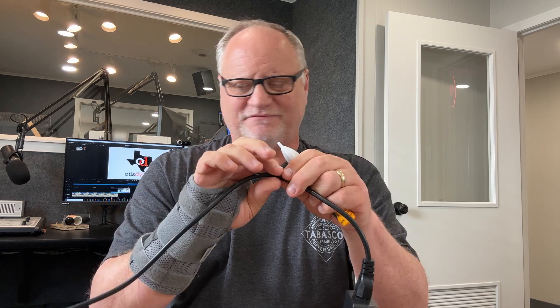What's also really good about these is if the cable's broken or has been pinched — I've had cables break — and it's like you're getting signal here but not down here. Then all of a sudden you get it here again, but further down you don't. You realize there's a pinch right there and the line is broke — replace the line. So it comes in handy for troubleshooting too, instead of sitting there all day guessing what's going on.